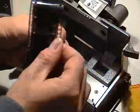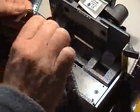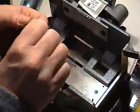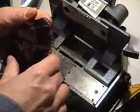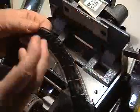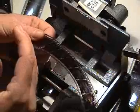If the join is correctly made, you should find that when you move the film like this, it doesn't crease. If you do a join and you don't have that slight overlap, you'll find that when you move the film like this, it will actually fold. And that can cause problems, especially if you're running off a platter, because the fold can get caught up in the feed unit. And I think that about covers it.